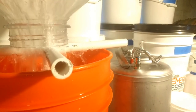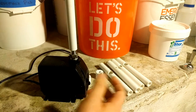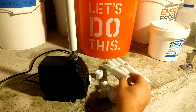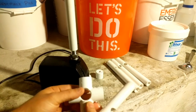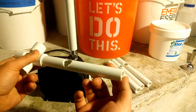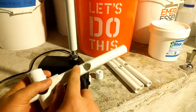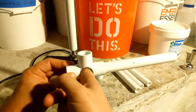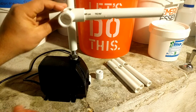The next piece is the stand. These 4 legs connect to a crossbar, which sits in the center fitting. The legs are about 7-8 inches long. Originally I had it without holes in the bottom, but I was getting a lot of drainage out the sides, which made a big mess. So I carved out some holes in the bottom and it completely solved that problem. The piece in the middle is just a 4-way fitting with a hole drilled through it, so my kegs and carboys have something to rest on.